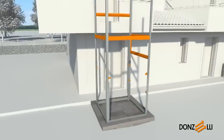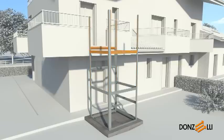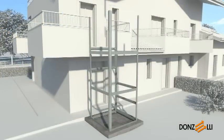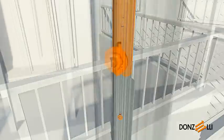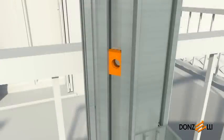The operation described for the ring in the bottom of the pit is then repeated for all the following rings in the first few segments. Before continuing with the installation, refer to the technical drawing to check the length of the upright segments to be used. To connect the following uprights, use the sleeve, which must be secured at both ends with two hammerhead bolts, washers and nuts, tightened to up to 30 Nm. First check whether one or more square nuts need to be fitted into the seat on the uprights, ready to fix cross beams in line with the upright-upright joint.